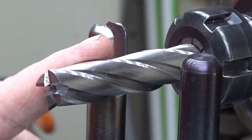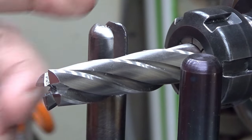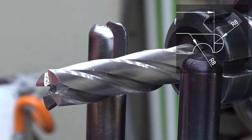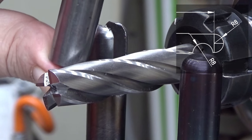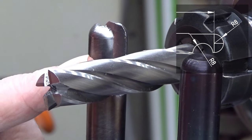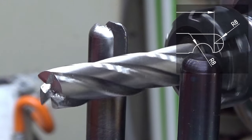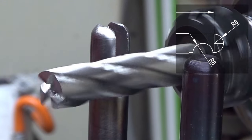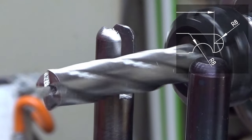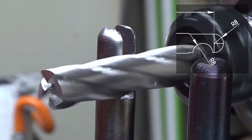Okay, here we have a 16mm end mill, and it's quite long as you can see, but we are going to side mill here a recess in which this 16mm pin fits in, and it should go at least half the way. Well, and I'm really running this slowly, and this is just milling by sight. I don't measure anyway how deep I go here.